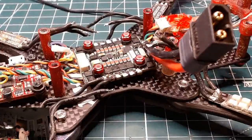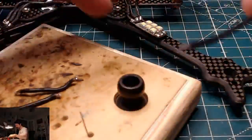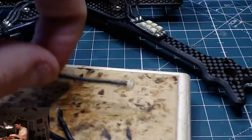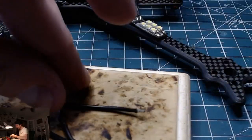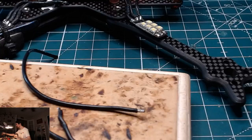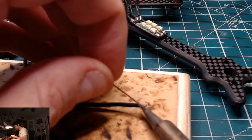What temp are you soldering at, Ken Hill asks. I am at 666 right now. I've been moving around, so my old iron didn't have a thermostat in it. So basically, the name of the game was turn it up as high as it'll go, and just pray. I'm bouncing up and down lately to get a feel for what I like, because turning this thing all the way up with the thermostat is actually too much, which is crazy. I didn't think there was such a thing.